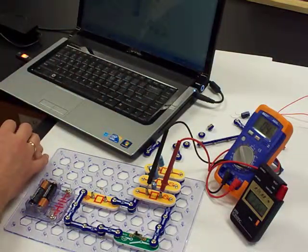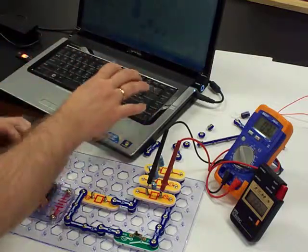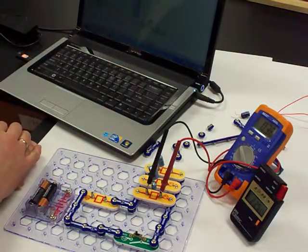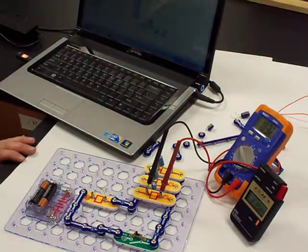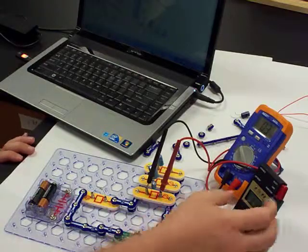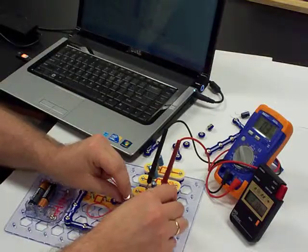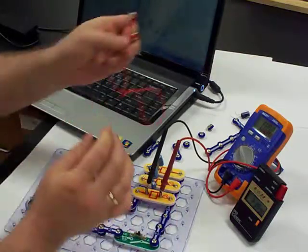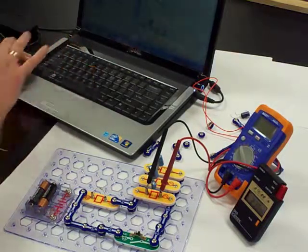I didn't miss a data point, but if you missed a data point, that's okay, just leave it blank then. You don't have to start over again, you just deal with one fewer data points, and the analysis will still work out as long as the data are good. Alright, and here we go, and I can stop that, and if I really wanted to, I could discharge my capacitors, and there it goes down to 0. Alright, and then I got my data to evaluate.